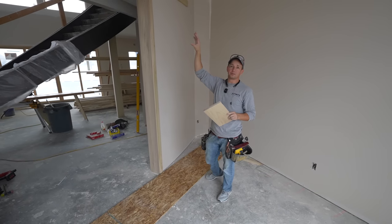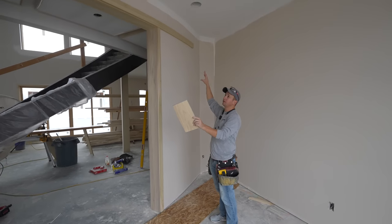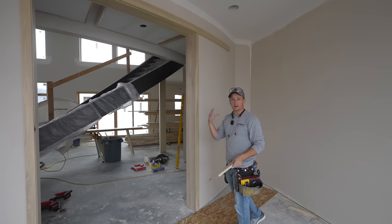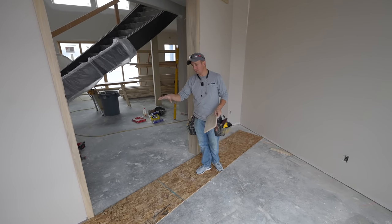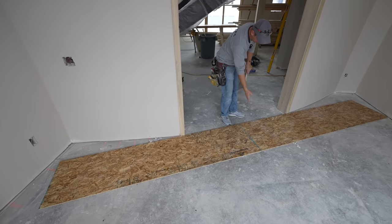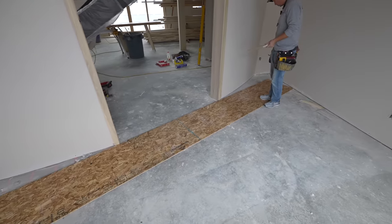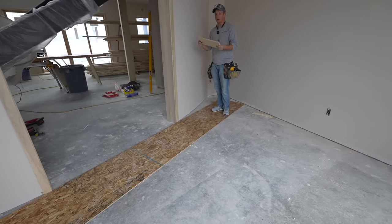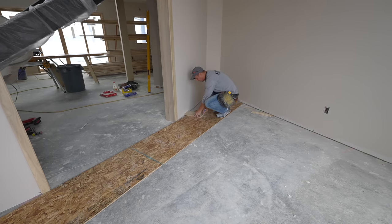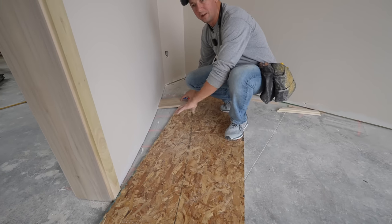In order to bend our header piece for this barn door, I had to figure out how am I going to make a form for something this long? It's almost 14 feet long here, so it was kind of a unique situation. I ended up having a sheet of OSB on the job site. I ripped it in half, put the two pieces together, made sure my factory edge is together nice and tight, and then opted to just scribe the wall to this plywood.